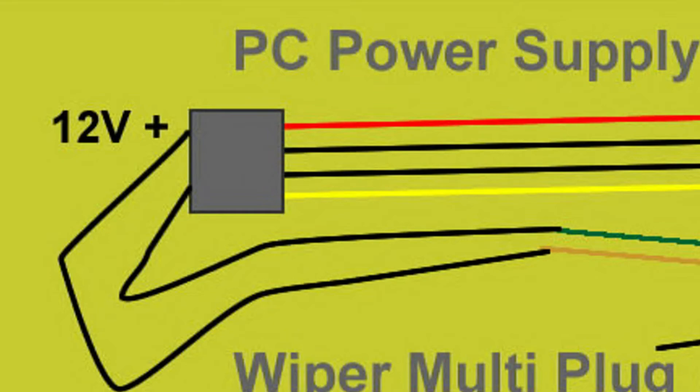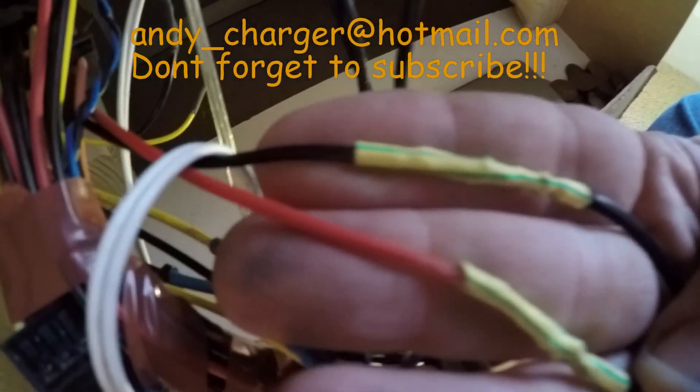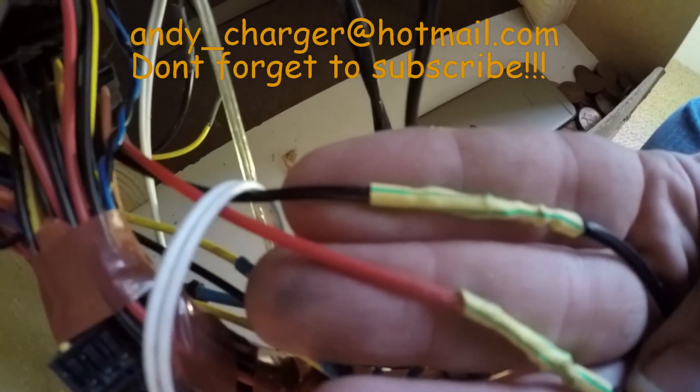As you can see from this close up of the diagram, the 12 volt positive power from the PSU — the red wire — is wired into the brown wire on the motor, and one of the black earth wires from the PSU connector is wired into the green wire. I have used a bit of heat shrink around the wires to insulate them. I hope that helps those of you that have asked, and remember if you have got any questions feel free to drop me an email. Thanks for watching.